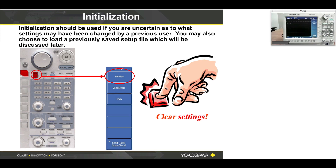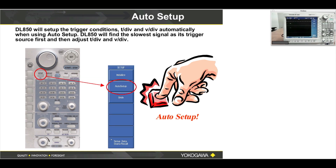We can repeat that exercise if we want to connect a signal. Go ahead and take your probe — hopefully you have a probe. In the video you see my blue probe; this is the isolation probe. Connect it down here in the rightmost corner where my finger is, to the probe compensation waveform.